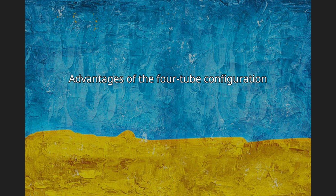Disadvantages of a four-tube system were increased costs, a larger and heavier camera, and reduced light levels when the color tubes' light was stolen by the luminance tube, making such a camera less suitable for outside broadcasts in low ambient lighting. An alternative way of producing a sharp luminance image was the three-tube luminance, red-blue camera, the YRB camera. However, this system was not favored by most manufacturers because it was deficient in color hue fidelity. Even so, a three-tube camera of this type was produced by Bosch/Fernseh, their type KCU40.